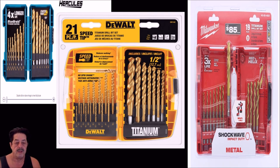For masonry bits, I use Bosch — I only buy individual bits, not a set, since they can get expensive. I have a half inch and one other diameter. The Bosch tips are tungsten carbide and glide right through masonry. I would use a hammer drill for masonry — using a regular corded drill is hard on it. I've paid as much as almost $20 for one masonry bit, but I buy good quality because I don't want to fight the drill all day.